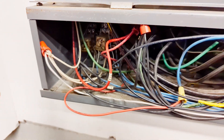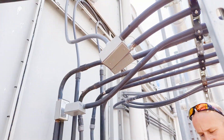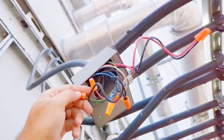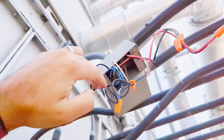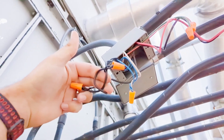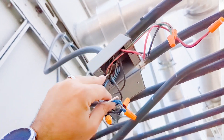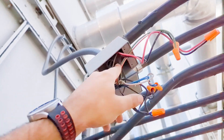We're passing through, up and over, and we'll open this up and see what's inside. Those are capped — green and red caps. The black is black, and our blue does turn to white on the other side. So blues are neutral and blacks are common.